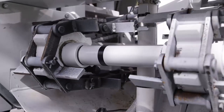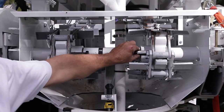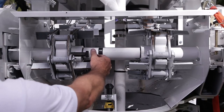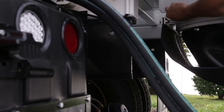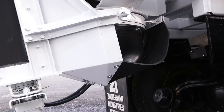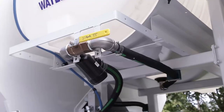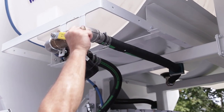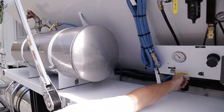With the unit loaded, remove the fine and coarse aggregate pins at the rear of the unit. This will enable the unit to be operated while discharging only one ingredient. Remove the pins that hold the material containment flag, located at the rear of the auger, and secure it so that the container may catch all of the materials being discharged. Make sure that the water and admixture systems are also disengaged so that they will not interfere with the calibration.